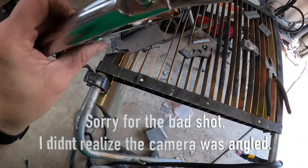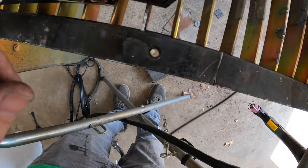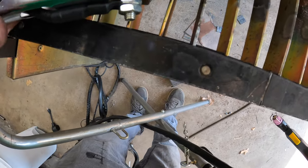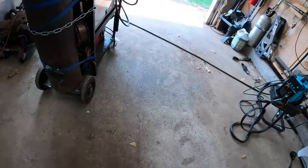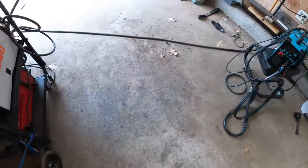In an effort to save the machine and not send stuff all over my shop, I stopped — it got three-quarters of the way through, which is roughly about three-eighths. Not bad; I didn't expect it to be able to do three-quarters. Plasma cutters are great, but that material that's cut goes somewhere. You can see a lot of aluminum — the steel kind of burns off and turns black, but the aluminum goes everywhere. The cleanup is kind of a pain.